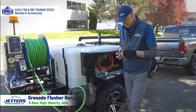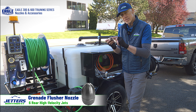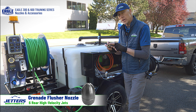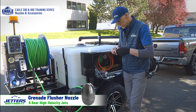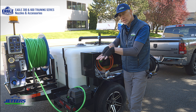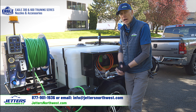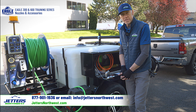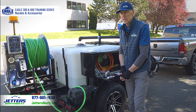For general cleaning of bigger sewers, the heavy grenade flusher is really wonderful. It's heavy, which keeps the hose down at the bottom of the pipe for flushing, and it has turnaround technology inside the body that smoothly turns water around so the jets really carry — ideal for larger lines and storm drains. We also have flat nozzles that jet just the bottom of the pipe for even bigger storm lines where all the debris is at the bottom — no reason to waste water spraying the top. If you have questions on nozzles for a particular job, give us a call at 877-901-1936 or email info@jettersnorthwest.com — we have just about every nozzle solution for any jetter up to about 60 gallons a minute.